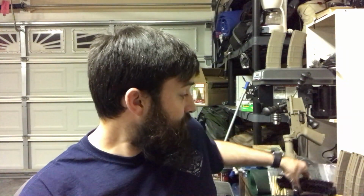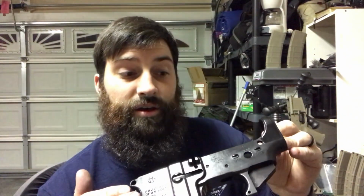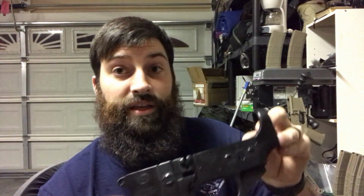And with the lower, again, I'm probably repeating myself, but I soaked it in acetone, made sure I got all that off. I rinsed it with distilled water. I washed it off with Simple Green, put it again in distilled water, and then I put it in that lye bath for a couple minutes, took it out, distilled water, made sure it was all cleaned off again, and then back into the, actually I think the first step I'd use Dawn dish soap. See, I even get confused.